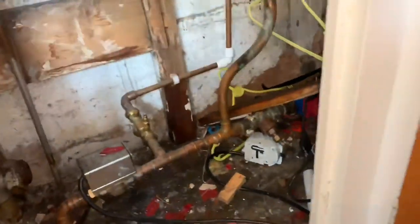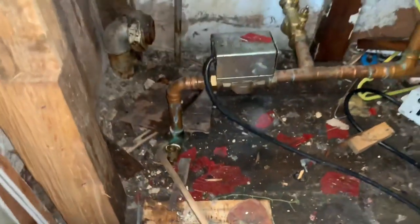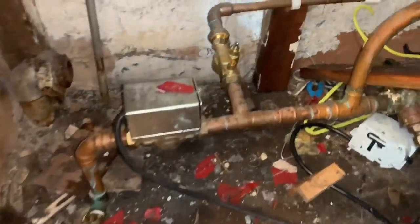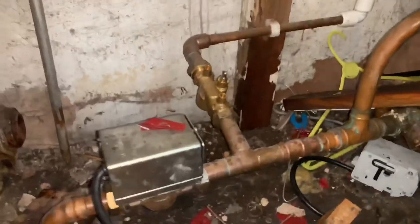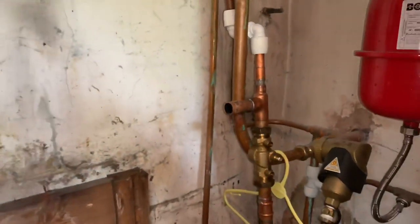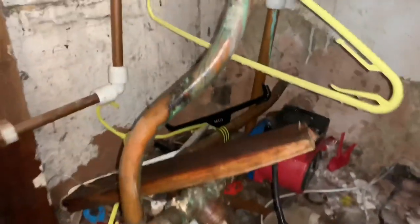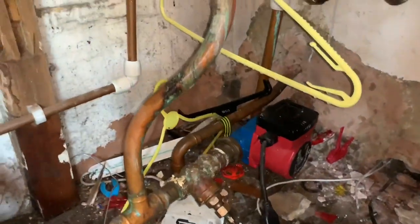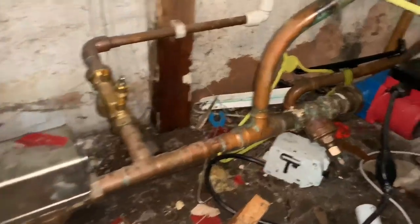I'm not going to cut these out until I know the old system works perfectly. But I'll cut all this back now and we've got access here. That's the zone valve for heating downstairs — easy enough to work out. And that zone valve there goes upstairs, so that's the upstairs circuit. This zone valve here is for the hot water cylinder, so it's all straightforward in here. The pump is there — actually the pump's on the return, which is interesting.